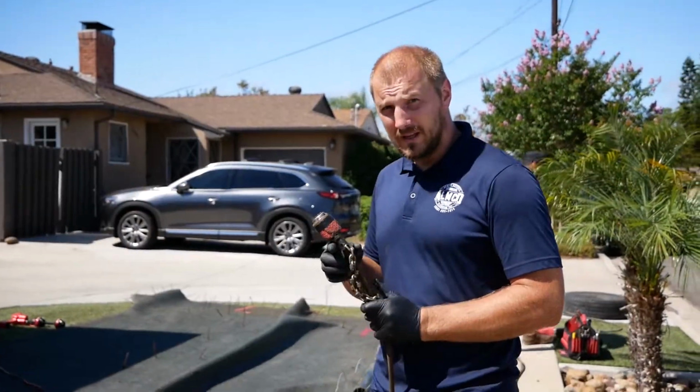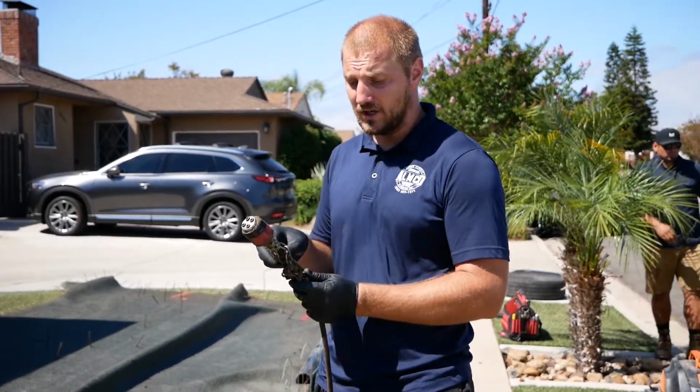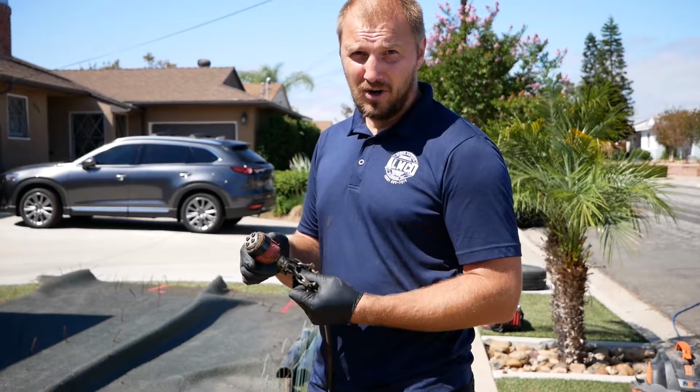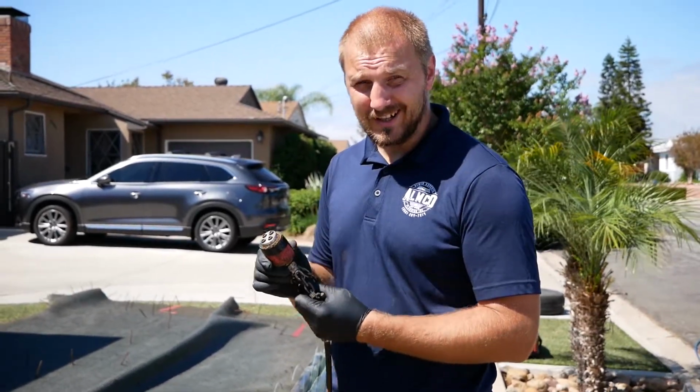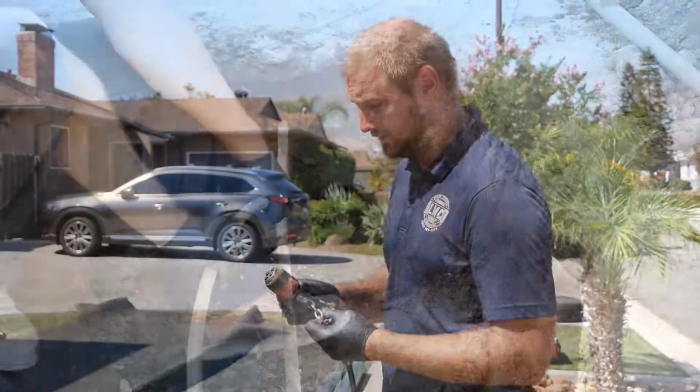Right now we're going to clean it with the descale, clean most of it, and then make it nice and shiny inside the pipe with a Picote machine and sandpaper. It will make it really nice and clean inside, so when we shoot the epoxy liner, it will be beautiful in the end.